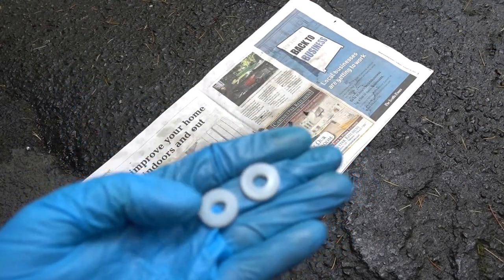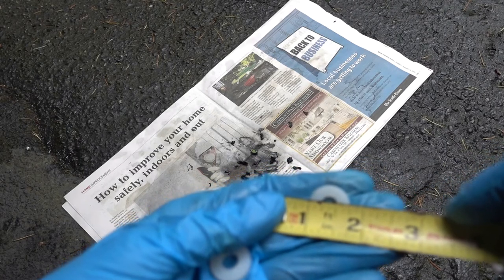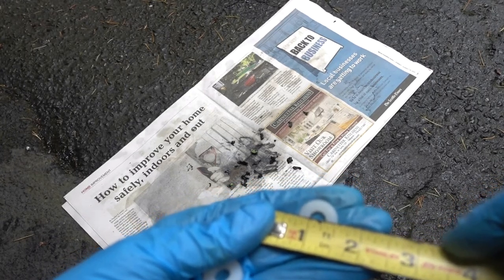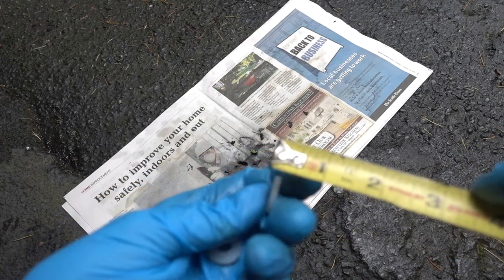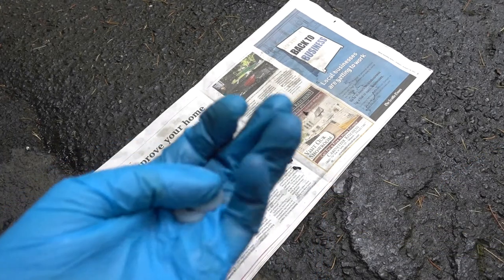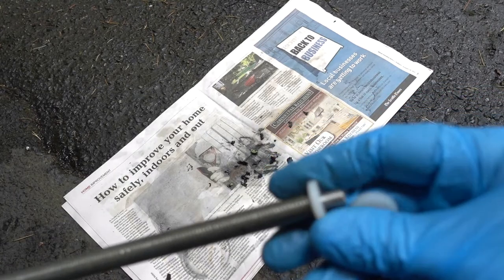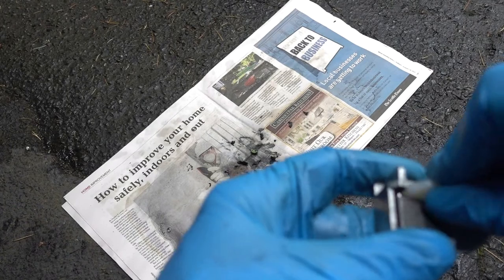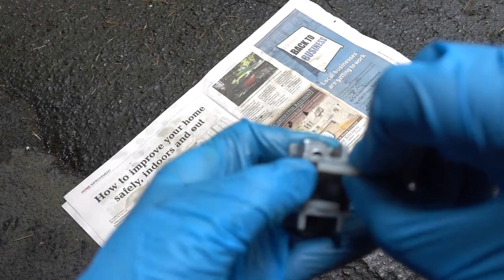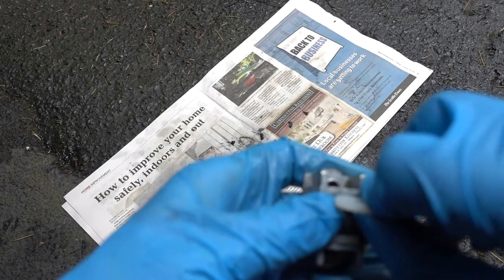These are my replacement washers and they're nylon — they have to be nylon so they don't degrade again. Dimensions are three-quarter of an inch with a five-sixteenths inside diameter. Thickness is one-eighth of an inch and that's the closest I could get; they are not the proper dimensions to fit. As you can see, it won't go all the way on the shaft. As far as the block goes, I could get one in but not quite the other. I'm going to have to sand it a little bit, but you do want it tight enough that you have to hammer them in, because any looseness is going to show up in the seat.